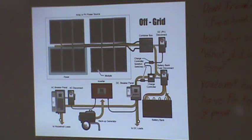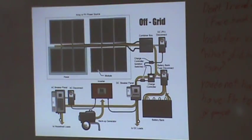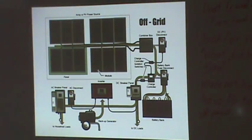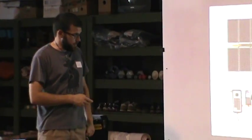There's a company now that makes a load lock, and I didn't put it in here, where you can load lock out your house. The main breaker gets tied in so that when you pull it up and over, it cuts the grid away from you. So you could actually backfeed solar through that, or your generator, things like that. There are some options about that now.